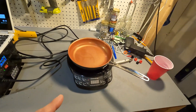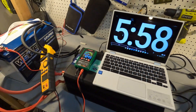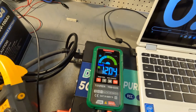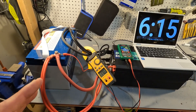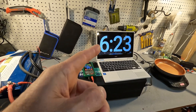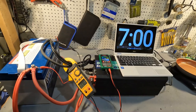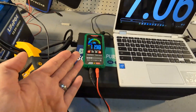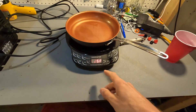Now introducing 600 watts from the cooktop. Amperage is up to 170 amps and we're down to 12 volts. The battery says it can run 200 amps for three seconds, so at 170 amps it's definitely running longer than that. At seven minutes it's still running, right around 170 amps, and voltage is at 11.98 — basically 12 volts. Let's bump it up to 900 watts.